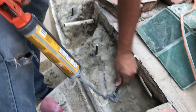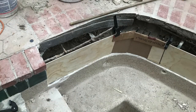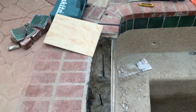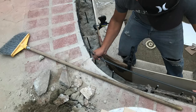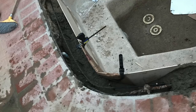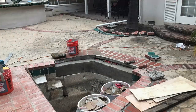Now we're going to epoxy dowel our rebar into clean gunite as we did in the first repair. We want to get a solid bond. We'll board form and get everything ready, and we want to show you how we tie. We'll leave some existing rebar in there where we can — anytime we can save rebar, clean it up, we will. We tie our rebar to our bonded steel dowel to get really good adhesion for when we pour with concrete. After pouring, we pop the board forms off — thickness of board forms is approximately the thickness of tile — and now we have a solid beam to work with.